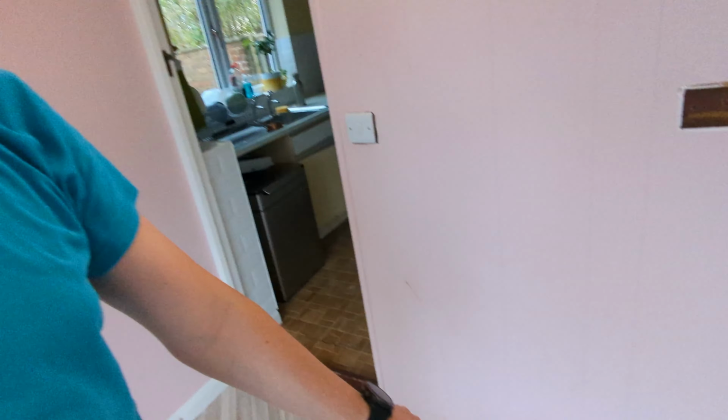Yeah, I'd recommend, if you're using a multi-tool to cut the paneling down there, try and use something quite nice and long. I was using a small spacer, made it really awkward to cut the paneling. Yeah, with the knife, make sure your blade is super sharp. Take your time. And if you're not sure, call in a pro. I think if I had a room where I couldn't hide the lino under the skirting and paneling, I'd probably get a pro to do it. Or if I had to, buy some trim to go around the edge just to hide the cut edge. Or maybe use a little bit of silicone just to tidy up that edge, one of the two.